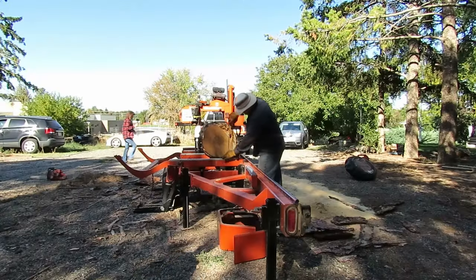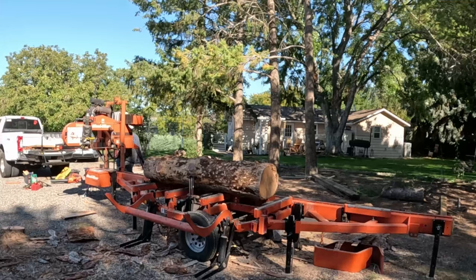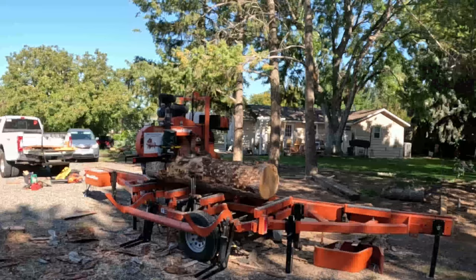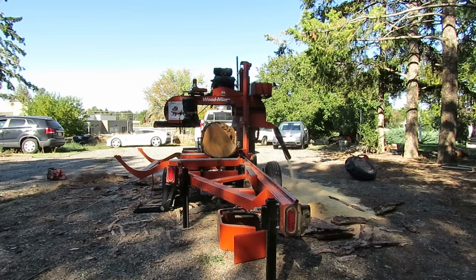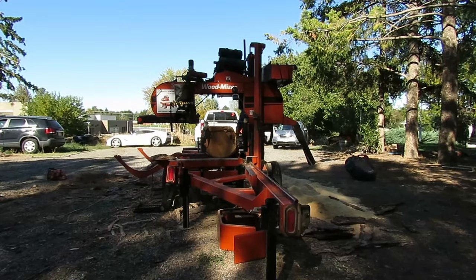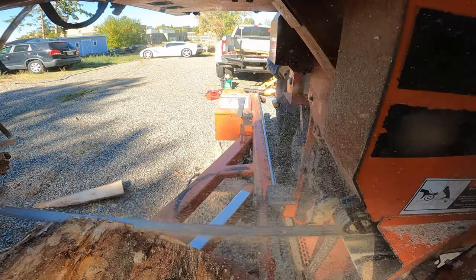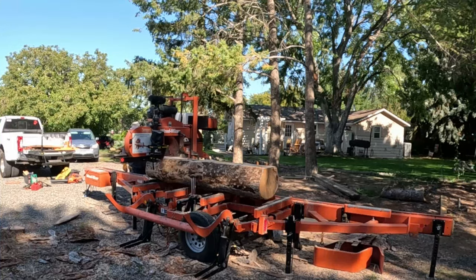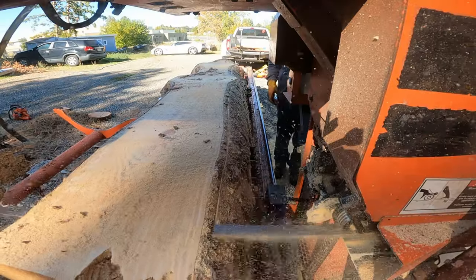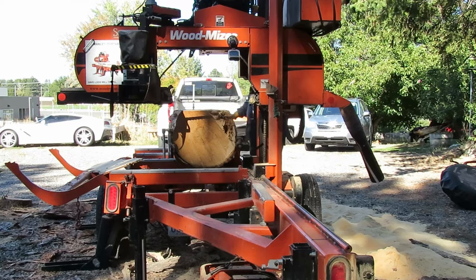Hey folks, welcome back to the channel. In today's video I'm going to talk about something that can plague bandsaw mills and their operators quite often, and that is knots in big pine logs. When you're milling a decent sized pine log like the one that's on the deck now — it's about 18 inches in diameter on the small end — those knots can be hard as rock. When you get two or three knots lined up together so the band is trying to cut them all at once, it can be a problem. You could run into waves. If you've already changed out the band, got a brand new one, checked your drive belt tension, and you're still cutting waves — that's what we're going to talk about today. First I'm going to get the band changed, and then I'll tell you what I did to solve this issue.